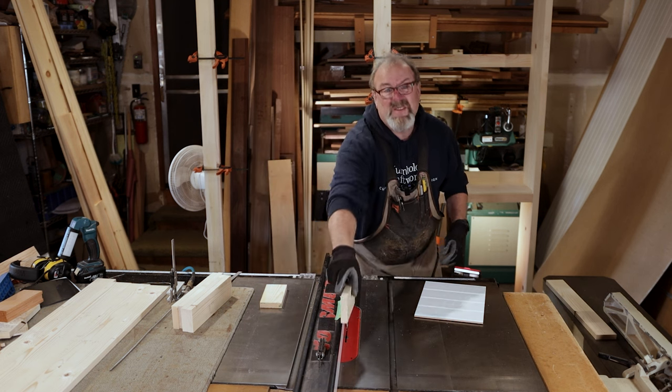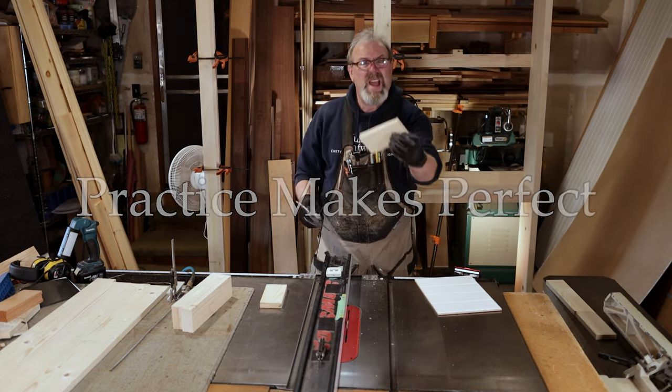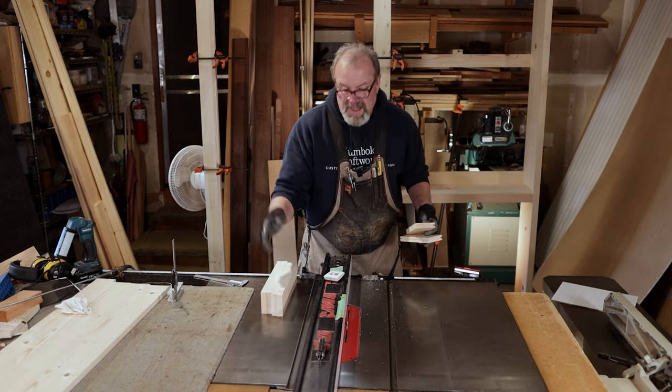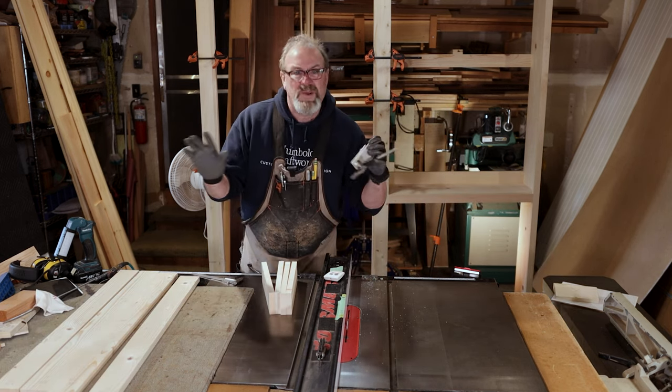And what I'm gonna do is I'm gonna take this and run it once. I'm gonna flip it around. I'm gonna run it again and we'll see if it fits. Okay, it works perfectly. We can just rip the rails like they're going out of style because the rails, we can go all the way through. These are the 4 styles. So we have everything labeled the way we want it so we know where to put the dado.